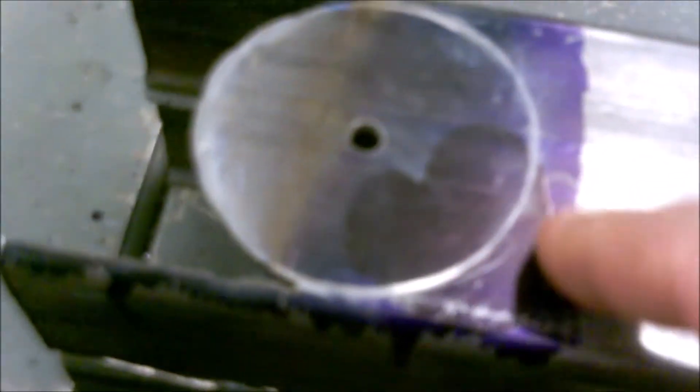This is where we get our cutouts for the round cross member at the front. This is marked with the radius of where our axle is — we cut away the front half, everything tangent right out, so on the inside it's cut away completely down to the radius. When the cross member goes in, it fits inside one side, and then we bend the tabs around to cap the outside of that cross member to make it look all nice and finished.